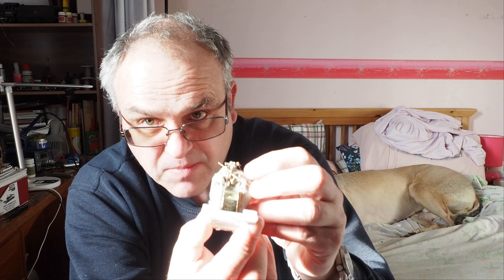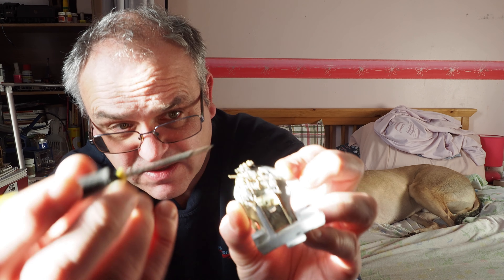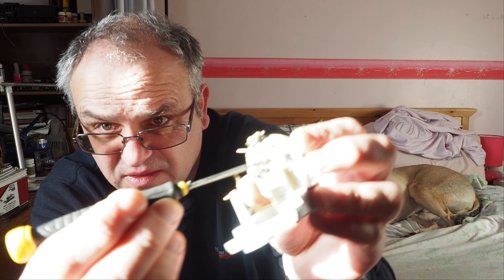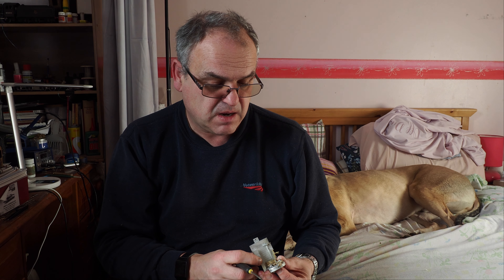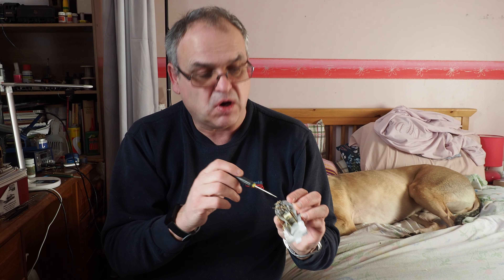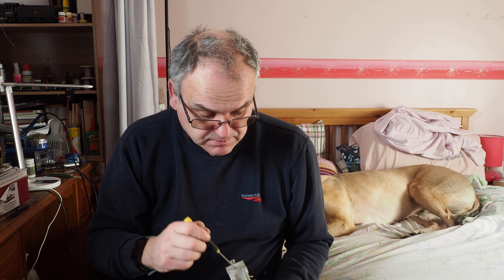I did the back head in a particular order because you will find that if you don't do it in this particular order you will not be able to get the pipework in. What I did, after having a bit of a think about it, is I started with the blower control which is this part here. That was the first part that I put in. Then I did the manifold on the top, which is this large casting on the top of the back head, and then I joined the two using the wire - because once you put the regulator in and everything you can't get at the other bits.